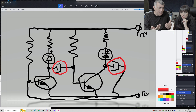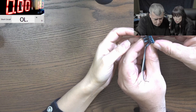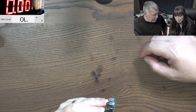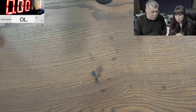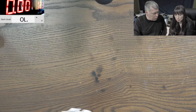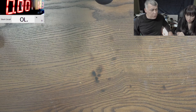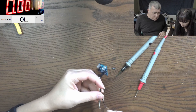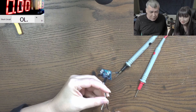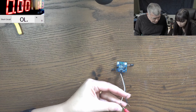You mean how to make it not 50/50 and how to change the frequency - how quickly it switches. Let's try to change the frequency first. You can change the frequency by replacing the capacitors - a smaller capacitor means smaller charging time, it charges and discharges quickly, so the frequency increases. The current capacitors are 22 microfarad 25V. Let's try 1 microfarad - remove them and swap both.